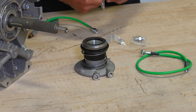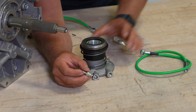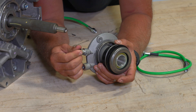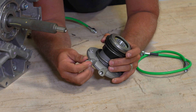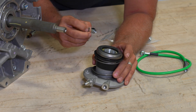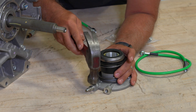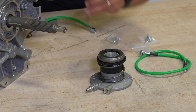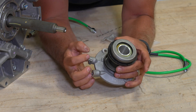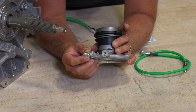All right, so you're going to take the fitting — the pin fitting — it comes with a little O-ring on it. This fitting goes inside the housing here, slides in, give it a little bit of a twist on the way in — you want that O-ring to roll over. You can put a little bit of oil on it to wet it, but it slides right in there. O-ring's clear, and it leaves a hole you can see all the way through. So then you're going to take the roll pin that you popped out of there and send that back in here — just knock it down until it's flush. Then we're going to seat it. Simple as that. The roll pin's all the way down in there — this fitting will no longer come out. The O-ring's sealed in there, so this is ready for attaching our line.